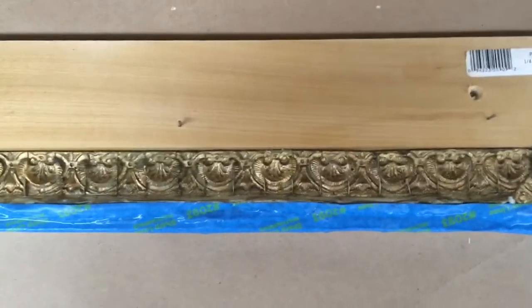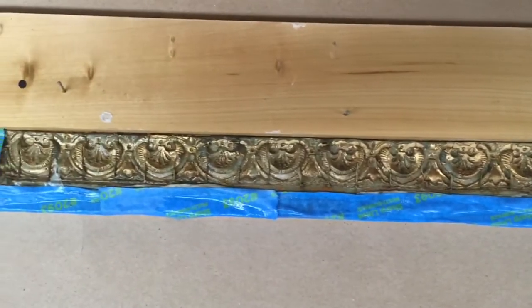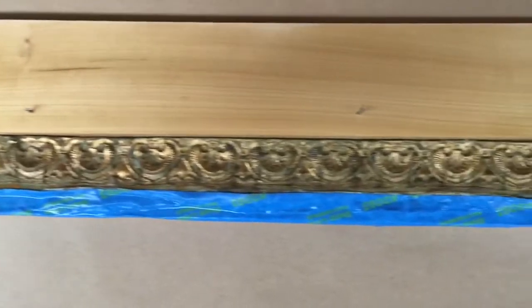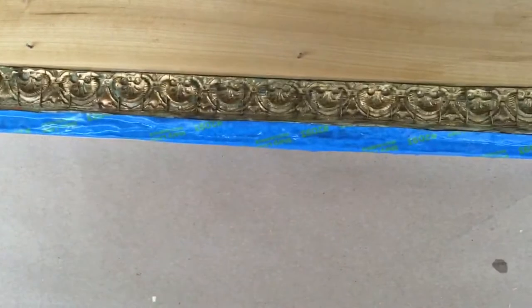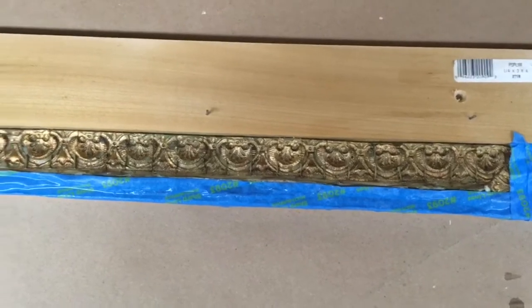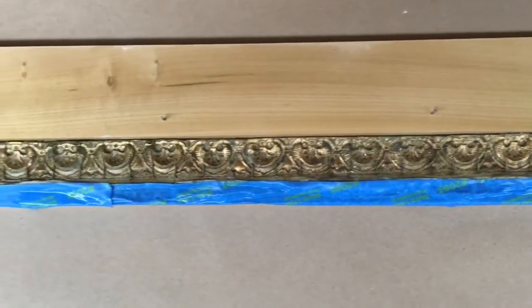What we're looking at here is the mold that you saw me peeling off — this is for the frame we are rebuilding. The mold is very rubbery, so it's up against a piece of poplar because I have to have a straight line all the way down here. It's been put down onto a board with ATG double-sided tape, the edges have been taped off, and it's been sprayed with release agent. Later on today you're going to see me pour the epoxy into the mold.